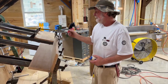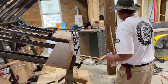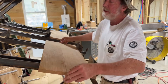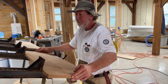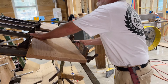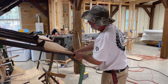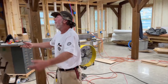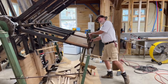We just put it here in the press. I know you're not going to have this kind of press — you can just take your clamps and clamp everything. Do it on a table because these are oversized. We're actually going to cut them down to the exact size we need later. Pretty simple: crank it down not too much, get the glue on there, then we rotate it, take the panels off, put another layer on, rotate, panels off, another layer on. These have been up here since yesterday. As we come in each morning, we pull out the panels glued from yesterday.